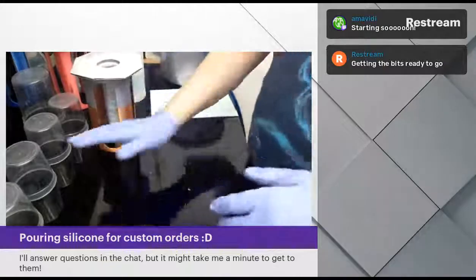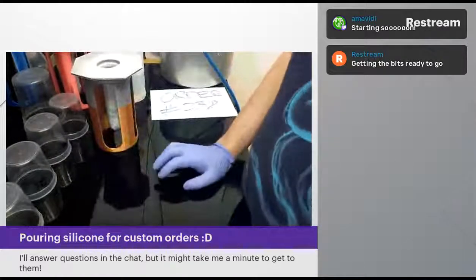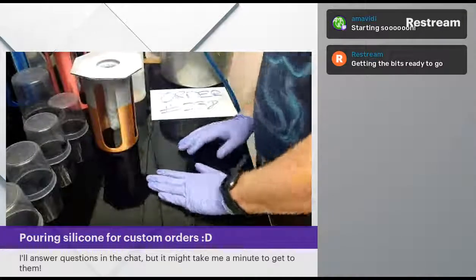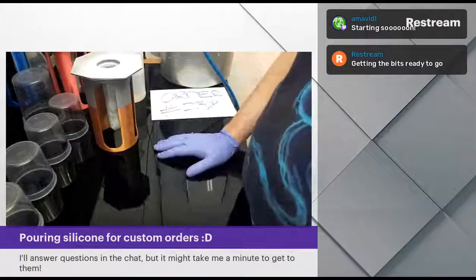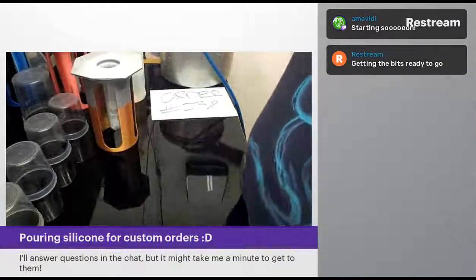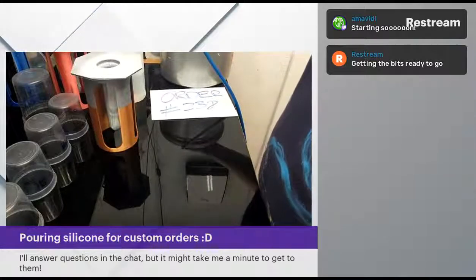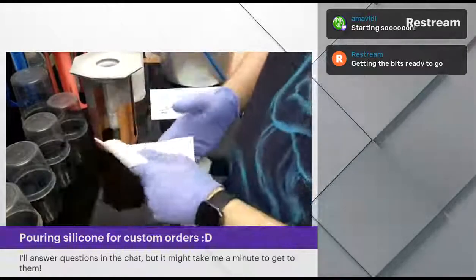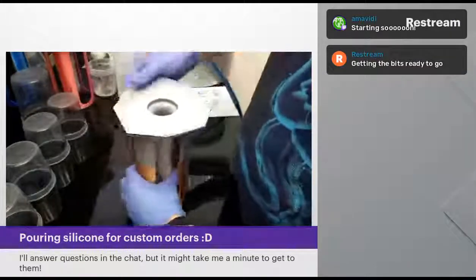Hey, yeah, I can absolutely answer questions as I go along. As for what we're making, silicone sculptures. And let's see, what are we doing? We're using platinum pure silicone, which I just mixed up. I got my pigment in there, which is body safe as well. And we just dropped it into the vacuum chamber so that we can vacuum out all the air, to make sure that when we pour it into the mold, we don't have any air bubbles trapped.